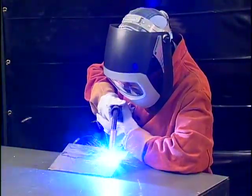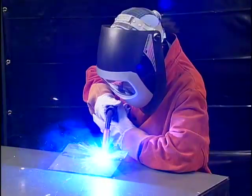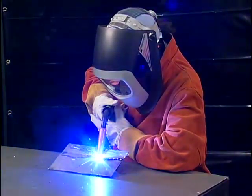As the amount of CO2 increases from ten percent to thirty percent in an argon-CO2 mixture, the wire transfer mode changes. The 75/25 blend, called C25, is probably the most common mixture of argon and CO2. Adding oxygen or carbon dioxide to argon causes the shielding gas to become oxidizing, which in turn may cause porosity in some alloys. In this case, a filler wire containing suitable deoxidizers should be used. By using the correct feed wire and a shielding gas mixture appropriate for the job, a gas metal arc welder can create the conditions that lead to a quality weld.